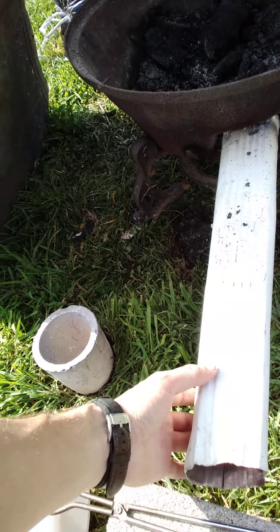I am 100% sad about that, and more than a little salty. My other setup here is literally a hole in the ground. It was originally about two and a half feet in diameter — you can see that dirt's kind of fallen in around the edges. I've got a mesh grill keeping the worst of the dirt out. And there is a pipe that goes from here all the way down and into the bottom to provide airflow. That is actually very effective — shockingly effective, even. You can get steel to a working temperature with that.